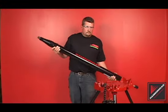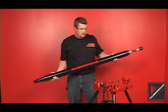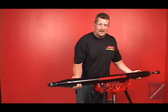Perform a tip test to assure the striker is sliding freely within the body. Tip the tool — the striker should float freely from one end to another. Following a regular service schedule will keep your hammerhead mole piercing tools running at maximum efficiency.